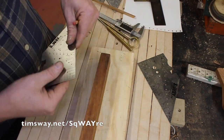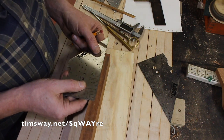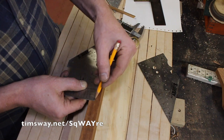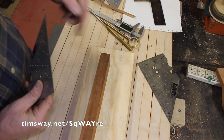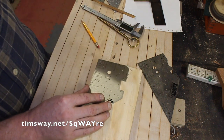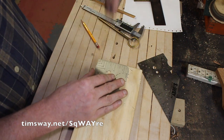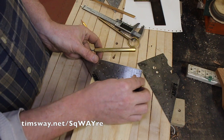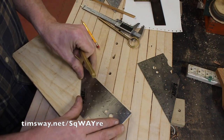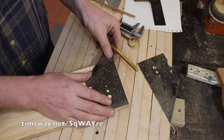You can also bisect using the circle — you can see it bisected there and bisected there, so you know it's straight and you can draw your line. Suppose I wanted to attach adjustable feet to the bottom of a table three-quarters of an inch away from the edge. Since I have the ruler on both sides and I have these holes marked, I can just go like this and mark where each of my screws is going to go to hold my adjustable feet — very quickly, accurately, and easily.